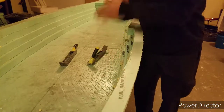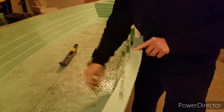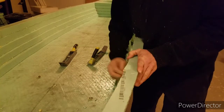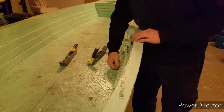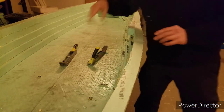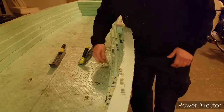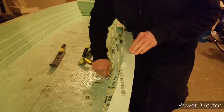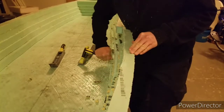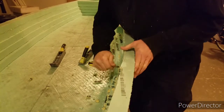With this stuff — I call it the beard, because it looks kind of like a beard growing out — it's often better to go ahead and just snap off any of it that you can, because it tends to resist the rasp digging into it. You can just take it off in chunks. A flat blade screwdriver can actually come in handy for digging them out, to try and get it down to something easier to smooth off.